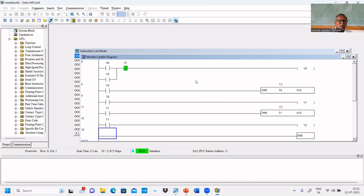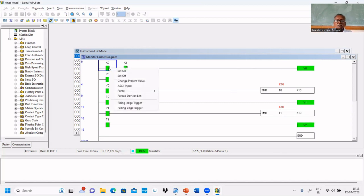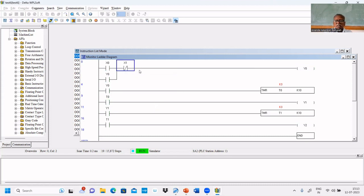Now let us simulate: Y0 should turn on immediately — let us check. Set on: yes, it is immediately turned on. After 10 seconds, Y1 turns on; after another 5 seconds, Y2 turns on. We will set off. If you give values like 50 or 100 you can easily watch the timing, because here we are using a toggle switch instead of a push button, so it takes time to notice. Let us check whether all are turned off immediately — set on: yes, all turned off immediately. If you turn on, one by one it is turned on; notice that.